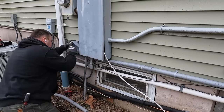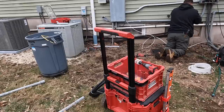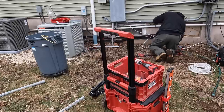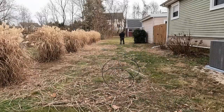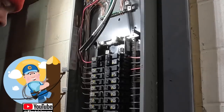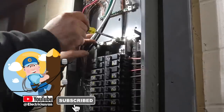I did the best with what I had. That white pipe is going across the window opening — I don't know if that's going to be a problem later since it's a means of egress. They've already got AC line sets going through the other window, which is a mess I didn't want to contribute to. Should this house go up for sale, a home inspector might point that out and it might have to be fixed. After I got that PVC in place, I pulled my feeders.